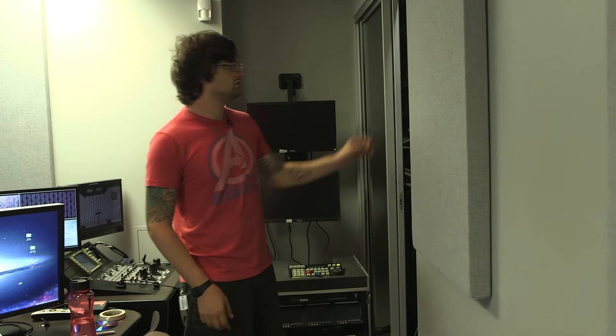Some troubleshooting tips. The first thing you want to do to make sure the recording is okay to be shipped off to Missouri City is to watch it all the way through with headphones on, so you can hear to make sure there's nothing wrong with the audio and that there's no digital artifacts on the screen. If you're not getting playback or if you're hitting a button on the controller and it's not sending any commands to the units, make sure your connections are good — check the cables, make sure they're actually plugged in and the connections aren't loose. Digital artifacts are caused by dismounting or removing a drive improperly — that would be taking the drive out while the unit is still on. Even if you've dismounted the drive, you have to power down the unit before you actually remove the physical drive. And that's how you do it.